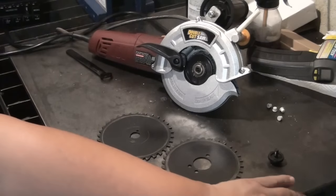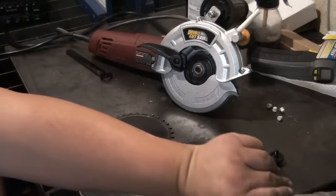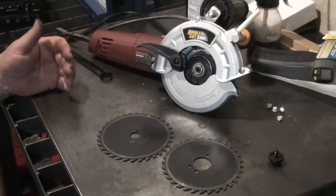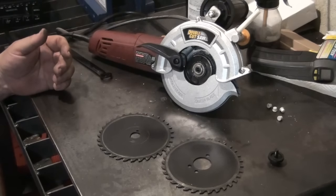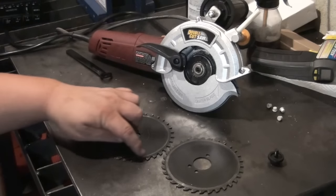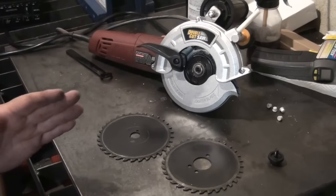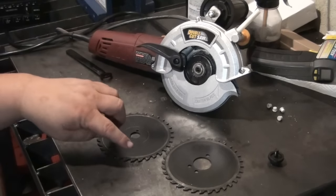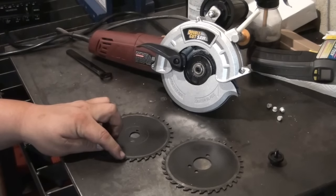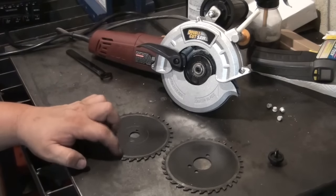Now, the first piece that I did was 1/8, which is this, and I was able to cut the 1 inch, which I did try, and it did cut it, but what a pain it was to cut that, because the aluminum bound around here, and it was cutting really weird. It was cutting a notch, but it also had this little thin piece of aluminum that was getting wedged in between the blades, because the aluminum was pretty much binding on this.